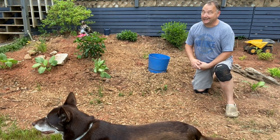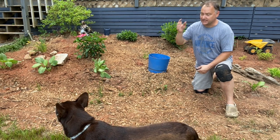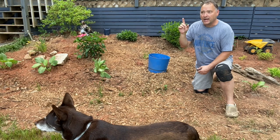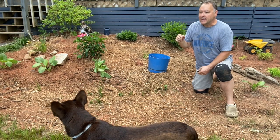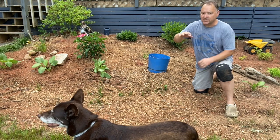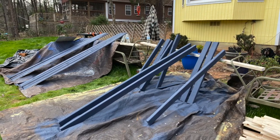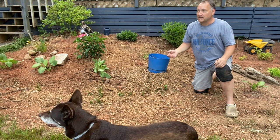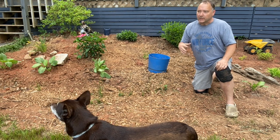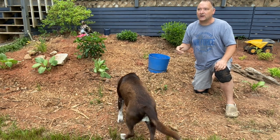And then of course there was the paint, and I got to buy a paint sprayer, which I highly recommend. Love this paint sprayer. You can see in the videos, I didn't get a lot of video of the painting, but I did get some pictures, some with Gomer and some with Hershey. And so I put those throughout the video. We just set up with sawhorses and tarps and sprayed them, because you have to spray all 6 sides, and sometimes you have to spray them twice. Kind of porous wood, but this was a good exterior heavy paint. So we did pretty good with that, but most of the time we would prefer to go with 2 light coats instead of 1 heavy coat. That dries better and does better.